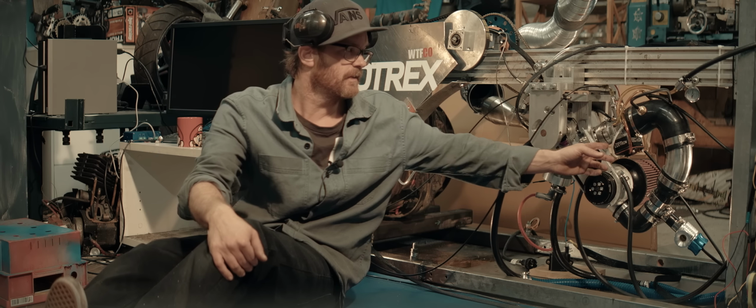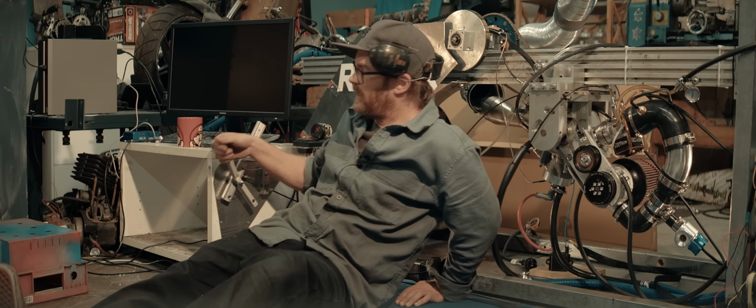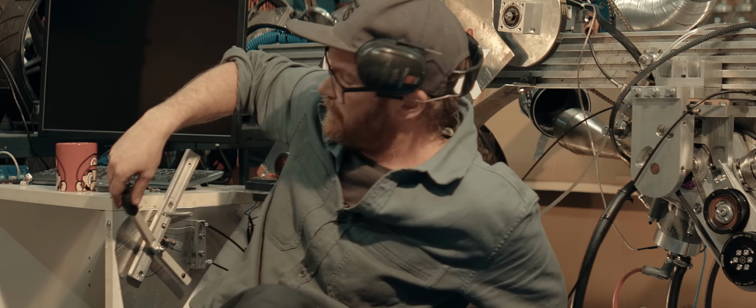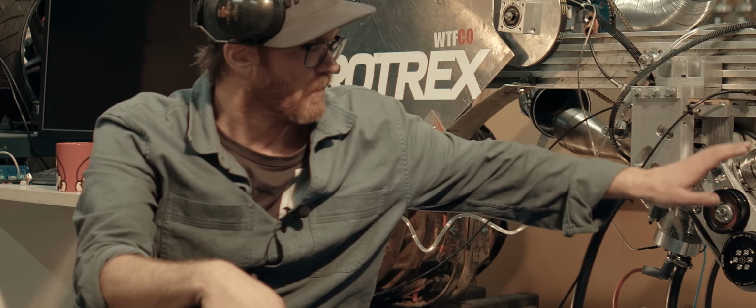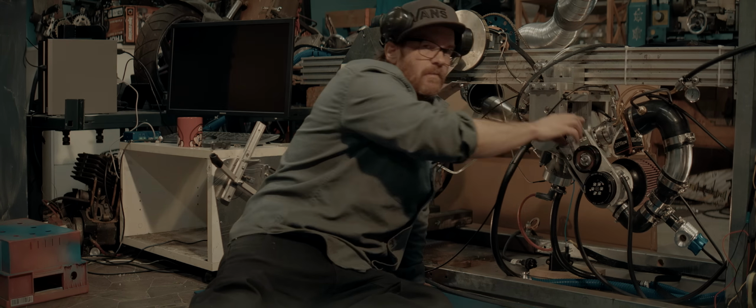Much better now, it's simply not getting enough fuel from that main circuit. You might have noticed how it picked up when I opened the reed valve. I think the reason for this is there's more airflow over the fuel passage. It'll be really interesting to see how it behaves on gas now, while purging.